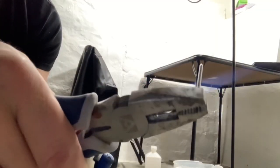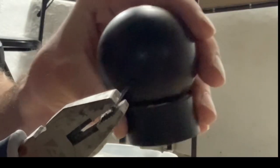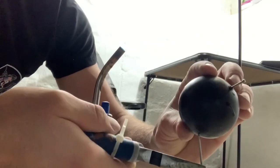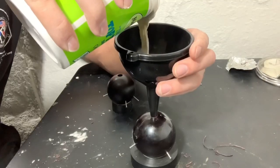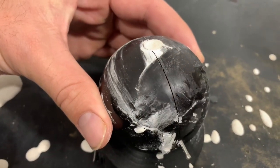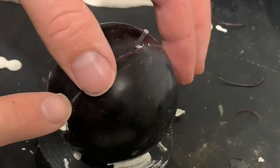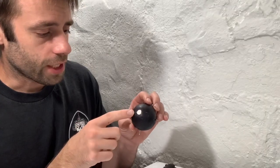Trying to beat the investment from hardening, I ran to get the nails. I heated the nail up because I figured it would go into the wax a lot better, but I overheated it by a lot. I learned that if I heat just the tip up a little bit, it'll go in without melting everything. The nails are going to hold the investment in place — when the wax melts and drains out, I need something to keep that hollow core in place. Apparently the investment expanded and cracked my orb, but at least it's in the wax and that's a pretty easy fix.